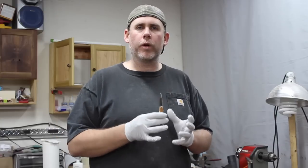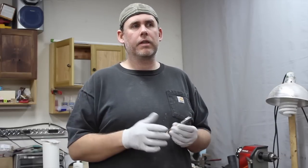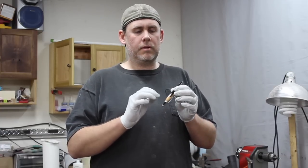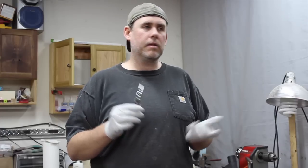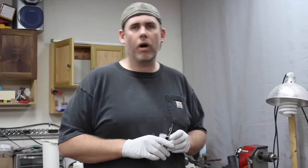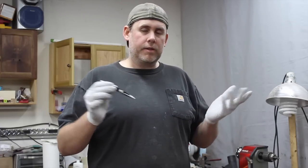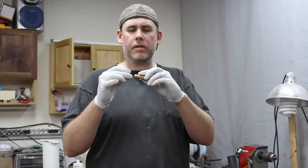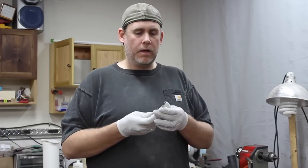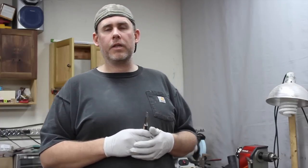You get really cool results adding wood that's got curves and different shapes, and filling those voids with Alumalite or any kind of resin - polyester resin works great, epoxy works great. Mixing resin of any kind with wood gives you really awesome results for pens and it's highly unique. You can get a piece of walnut and make a pen that looks like any walnut pen, but when you mix something like mountain mahogany and throw in bands of color, absolutely no one else in the world can make this pen - and frankly I won't be able to make it again because of its unique nature.